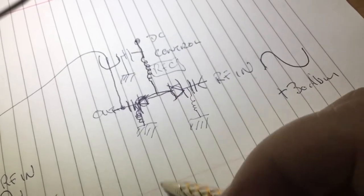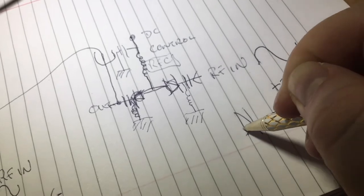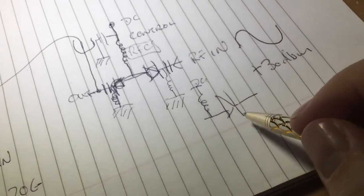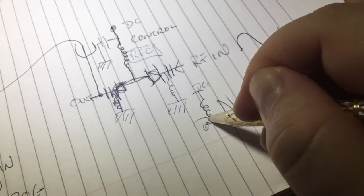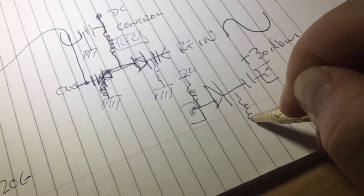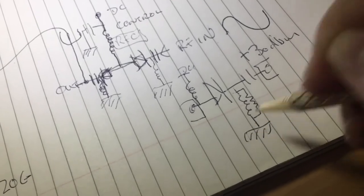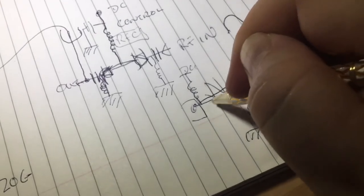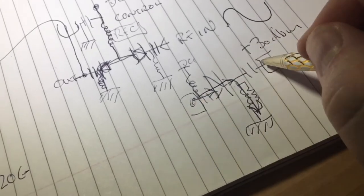It's not just a case of applying bias. You couldn't just have a DC control going to a blocking capacitor to an RF socket and expect RF to go through — until you introduce an RF choke or a resistor to ground so that there's a DC current flow through the diode, which then naturally presents an RF path as well.